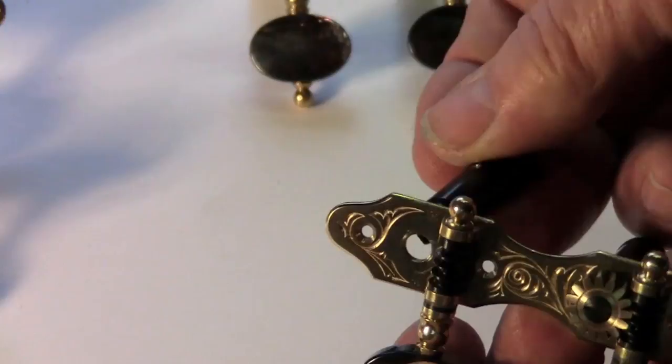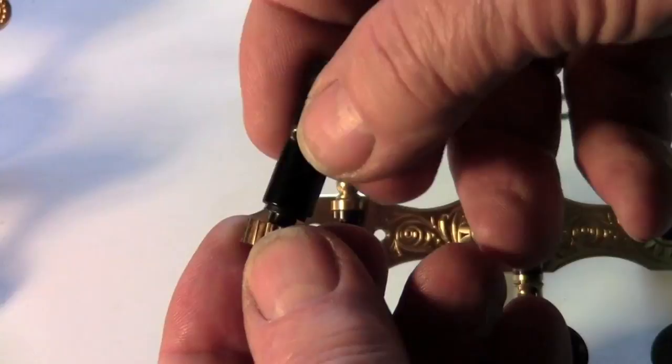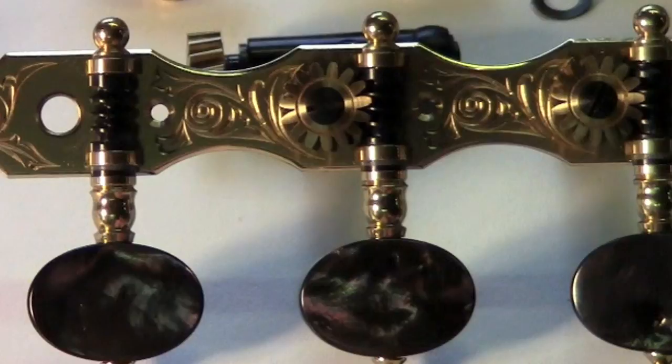The gear shaft is still loosely inserted through the bore. Where Rogers excels is in the fit of the gear to the gear shaft peg. This outstanding craftsmanship removes any slack between these two parts. Rogers' forte is the machining of his gear and worm. One can see very clearly that he has removed any unnecessary space between parts.